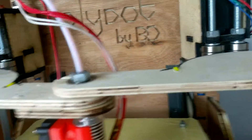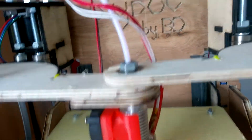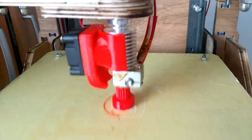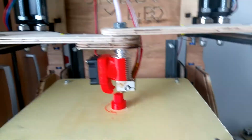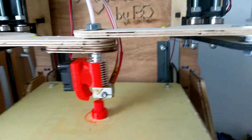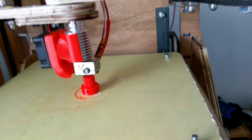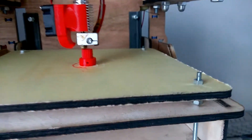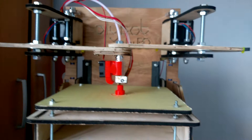I had to modify the firmware a bit and do the maths to control all this. In effect, you can get that to control this in the XY axis, because you have to edit the firmware - otherwise it doesn't move correctly. It doesn't move like an XY system would, so you've got to change it to account for the XY plane.